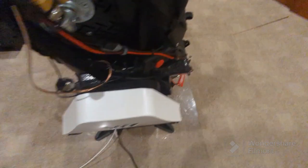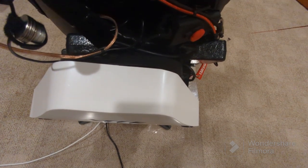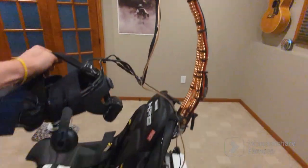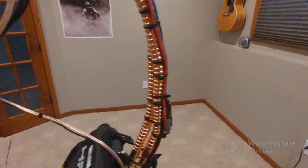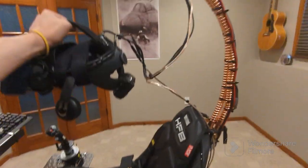This is heavier than the joystick — hence the offsetting of the zero-turn Toro Time Cutter 3200 front nose lawnmower weight. Now you know which one to buy that fits: Toro Time Cutter 3200 front weight. 25 pound — it matches. It's got a hook on it, it's perfect. It literally slides perfect — it's like it's built for it. So my rubber band's off. There was a rubber band going from that little zip tie straight back to the pull, so that would pull that cord back when the head goes back. Just pretend there's a rubber band right there.